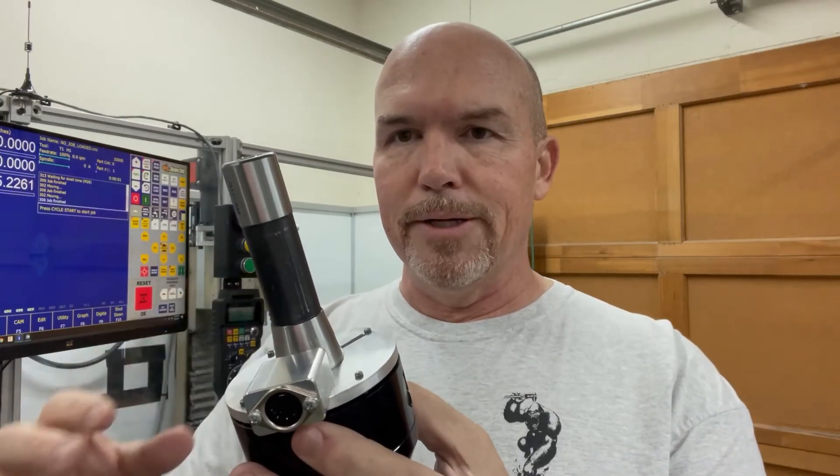I can take this and plug it into the interface unit that Renishaw sells — you can find those really cheap on eBay too. I found mine for $90 and it's really simple to wire up. I used a 5-pin DIN plug; they usually come with a DIN 3, but the 5-pin version has ready-made cables on Amazon for about five bucks.